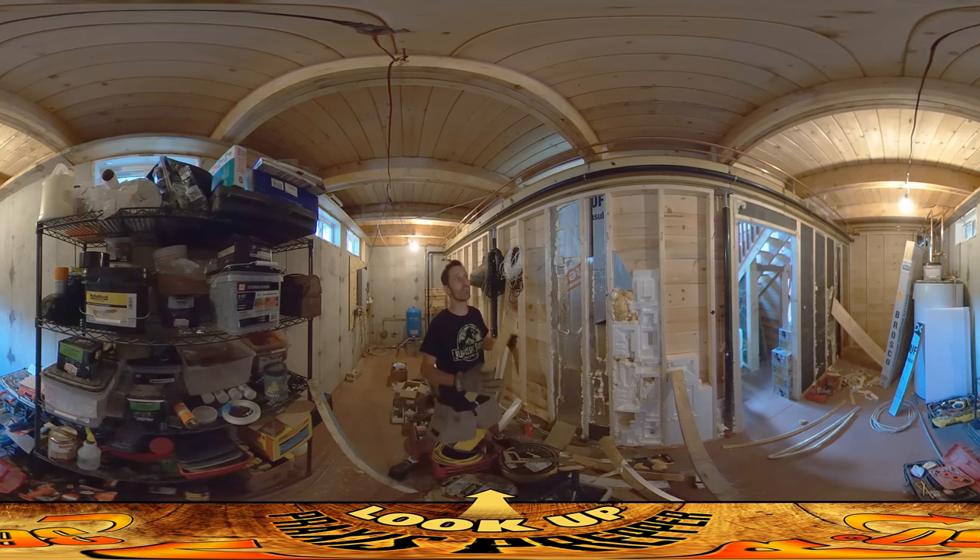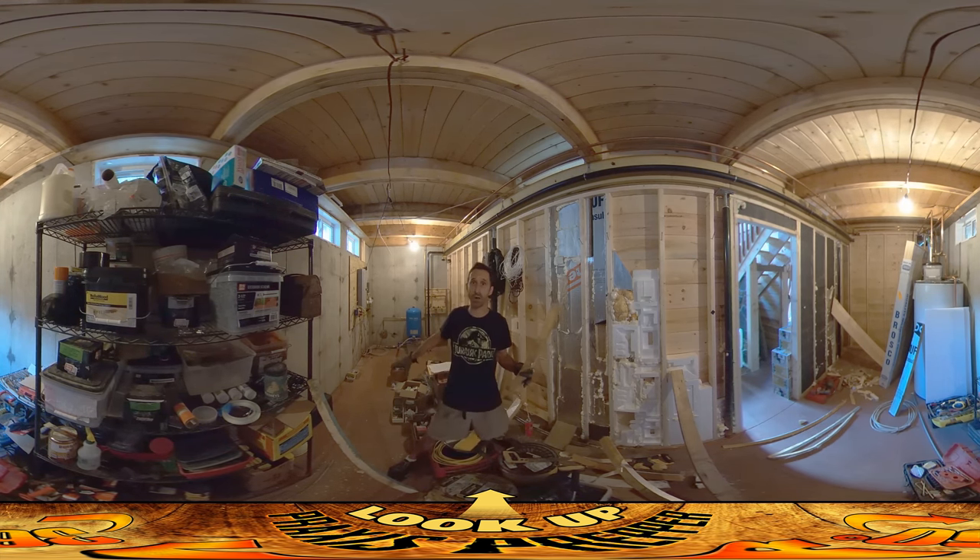The other reason I'm doing this is that I'm kind of forced by code. Because I left some of this area uninsulated, they say I need four inches of foam on these walls to satisfy code. The idea is that this area is an unheated space, so they're treating it as though it's going to be two degrees below zero at night in the middle of winter. Never going to happen — 50-degree thermal mass. 50 degrees is as cool as it's ever going to get in here.